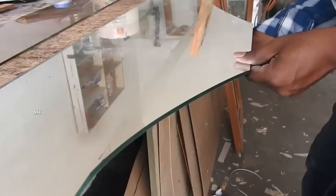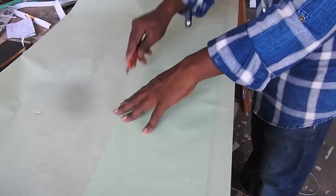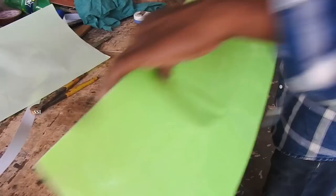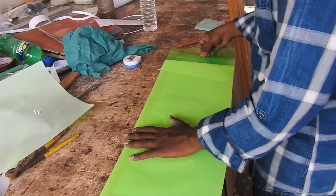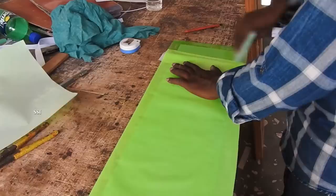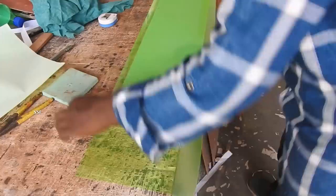After removing it, this is a resist. Place or apply the resist to the glass. A resist is a two-layered material — one is an adhesive layer and another is a silicone layer. The layer may be different according to the type of work. By using a flat wide plastic squeegee, apply the resist to the glass. It ensures that the resist goes down without trapping bubbles. After that, remove the excess part.